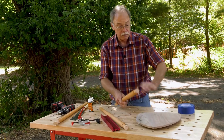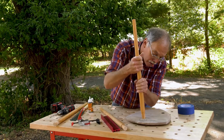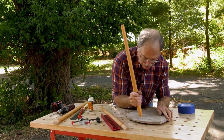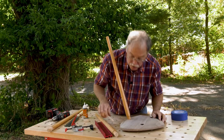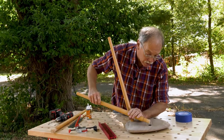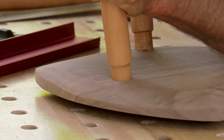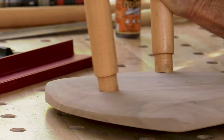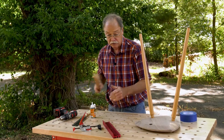So that's the easiest way to give me a new look and not have to wedge it like the other one was wedged. And you do not want glue in the joint of these mortises, because if you put that in there, it could squeeze as it expands the legs out. And aesthetically, I like everything about this look. I'll get the other leg in and then I'll show you how to do stretchers.